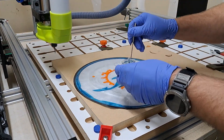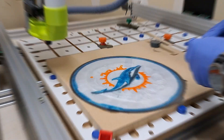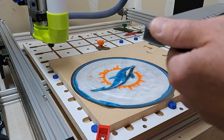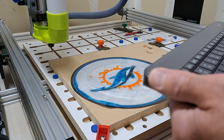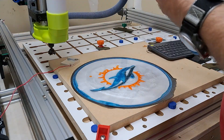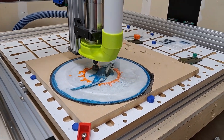With that detail pass finishing up, I can get things cleaned up and pour a slightly darker blue epoxy for the lower part of the body. Clean it up a little bit, and once it's dry, I'm coming back with my surfacing bit ready to go — just to take down some of the larger overpours of the epoxy. This will save some of the sanding and make life a little bit easier. I'm not intending to take it down too far, just enough that when I pull out the sander it's a little bit faster.